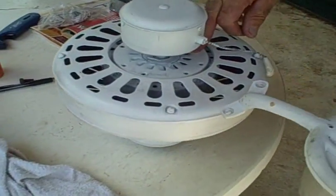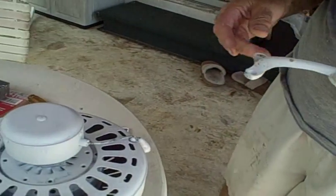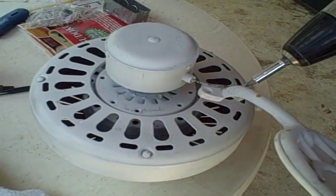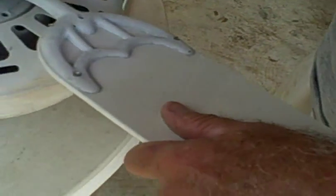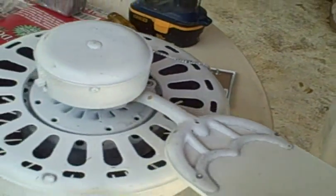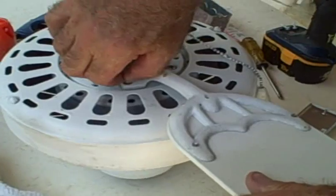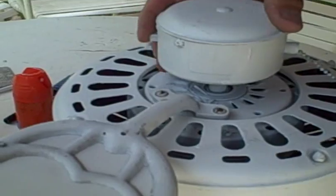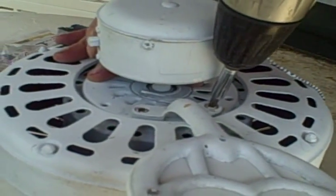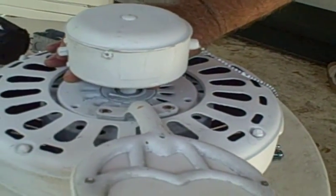And you see here, these are the holes where the fan blades go. The easiest way to do this — and I'm putting the blades on now instead of later because this isn't a hard installation. It's really kind of up to the installation as to what you do. I find the best thing is to use my screwdriver and kind of just get that seated a little bit, and then come back with the other screw. Now it's kind of holding itself in place and I'll just tighten them down. Just snug again, not overly tight. And I'll do that with the other blades in the same way.